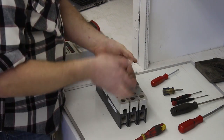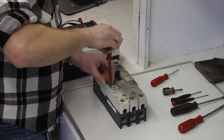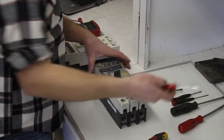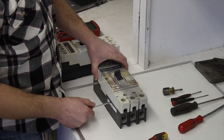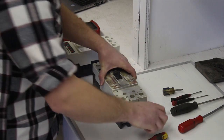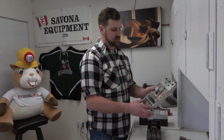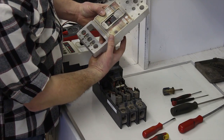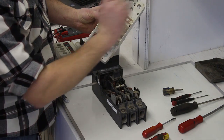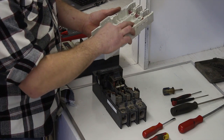I just took all those out and put them aside. Sometimes you might need a flat blade screwdriver just to pop this cover off if it's giving you any difficulty — if it's been on there for a while it's not the easiest to take off. Take that right off and this front part will come off. You want to be careful — there's a part here for indication: green is obviously for open, red is for closed. When you operate the handle open to close you want to make sure you don't lose those pieces, as they can be a little tricky to put back in.